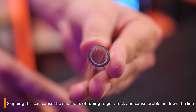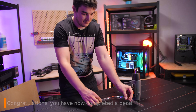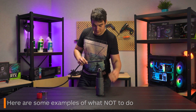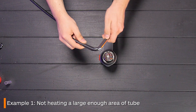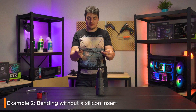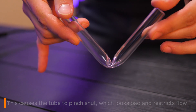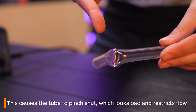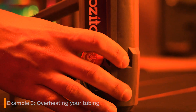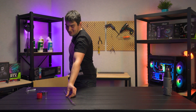Tap out the excess and you will have a clean cut. If you skip this step there is a risk of small bits of tubing getting into your loop and getting stuck somewhere. If you don't have a reaming tool, sandpaper can also work — and now you have just completed a bend. Here are some quick examples of what not to do. In this first example, heating only a small area of the tube causes it to kink very badly — you can technically still use it but it will look really bad. The second example shows what will happen if you don't use a silicon insert — as you can see the tube is basically unusable. Rigid tubing will always need an insert. The final example showcases what will happen if you overheat your tubing — you basically melt it and it bubbles up. You can technically still use it if you're really desperate, but I don't recommend it.